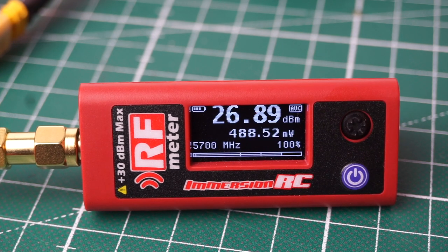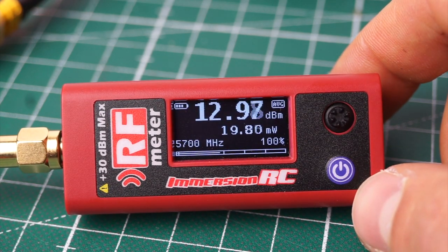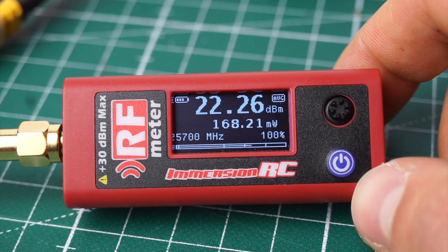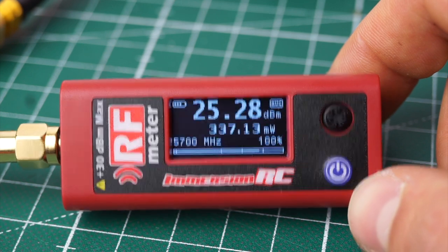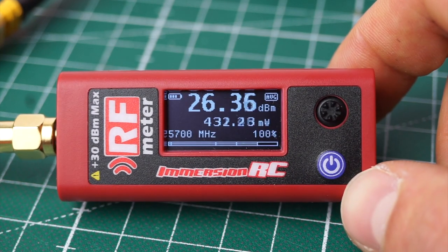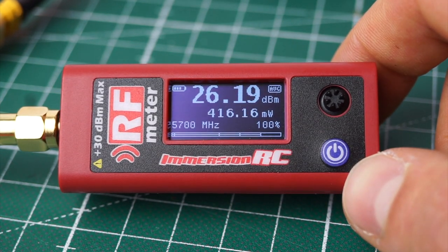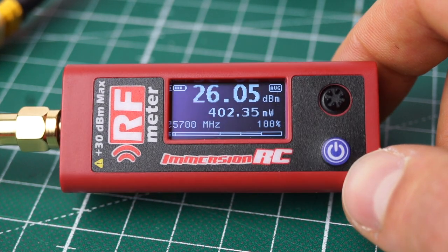It started up — I think that's the highest power level. Switched to 25 milliwatts, we have around 20 milliwatts, which is fine — below the legal limit. It switched up to 200: roughly 170, that's still okay. At 500 we're starting to see a gap — only 300, and it might also heat up. At 800, only 450. That's kind of disappointing — not the full power I expected. And it keeps going down because it's heating up. I'll switch it back to 250 so as not to overheat it.